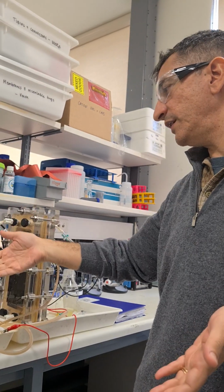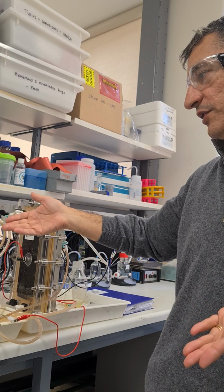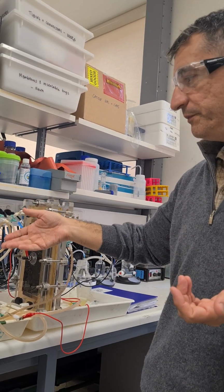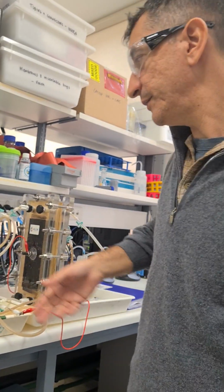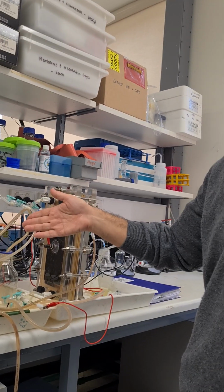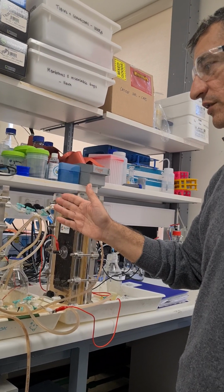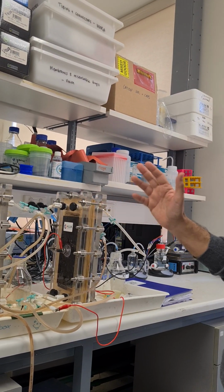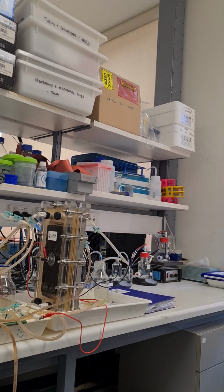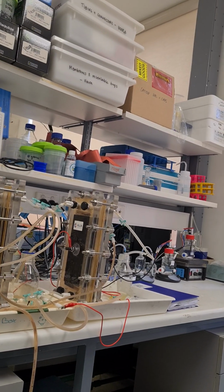The cathode is purely a stainless steel plate that makes hydrogen. Because of the conditions, you don't have much biofouling, because it's pH 9 and it's got ammonia. Never had a problem. The membranes do get some fouling, but it doesn't seem to impact our energy requirements much. So you don't need a chemical cleaning or anything extra for 1 year? Yeah, no problem.